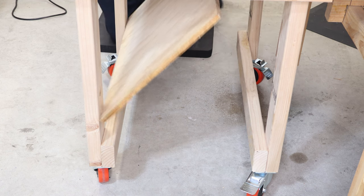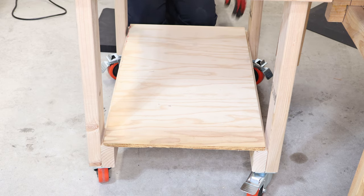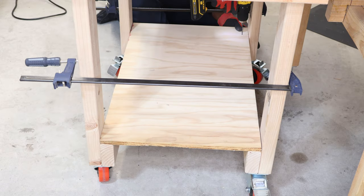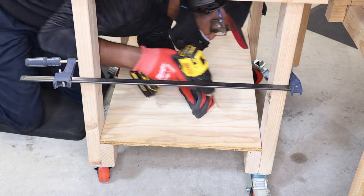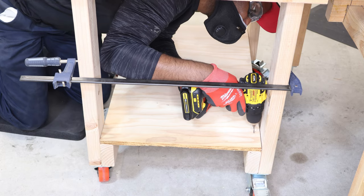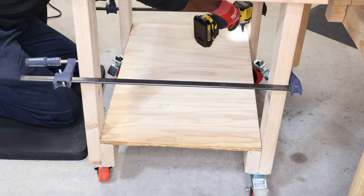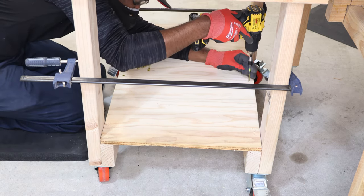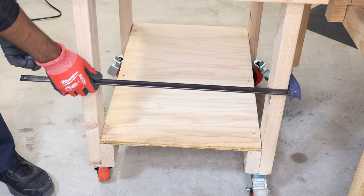We're going to put our bottom shelf in place on the floor — make sure you use knee protection. We're going to be here at least 10 minutes, and the older I get, the more valuable that becomes. We're going to drill our pilot holes, and as you can see, we're also using a clamp to pull it in — that's just the best way I've found to do it. If you have a better way, let me know down in the comments. Then we're going to drill our countersinks and put in our screws. Six or seven screws is good enough here — you don't need to go too far because it's pretty secure.